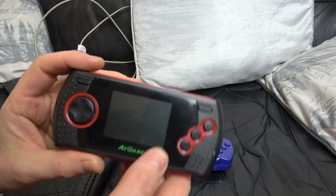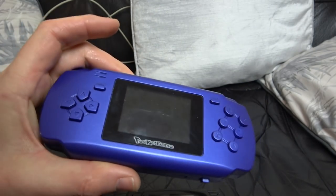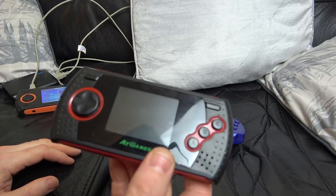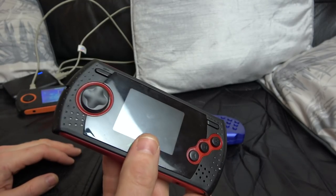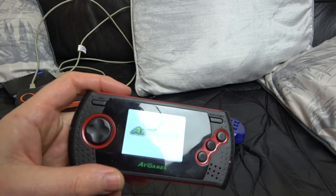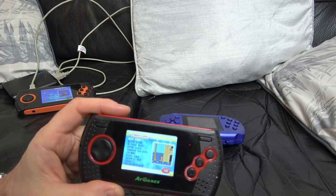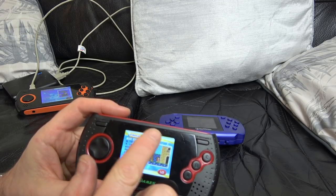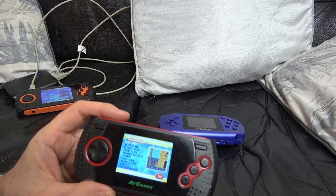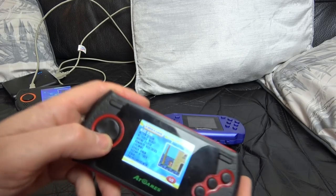And this one here was the more interesting one. So good news is now I can hopefully pick up another one of these very cheaply, or another faulty one, and then I can get this one fully working, which is good, because this is nice, because it actually takes the original games. And for this one now, the speaker was broken, so there was no sound and there was no picture either. I can't be certain what was wrong with the actual picture. Let me just turn this one on. But if I was to take a guess, I would say it was the actual connector itself. So maybe it wasn't sitting quite right, maybe there was a bit of a bow in it. And then when I redid it, I suppose it was nice and flat, and then it was contacting properly on the ribbon cable. Either that or the capacitors and resistors either side, it could have been. But there we go, all working fine.